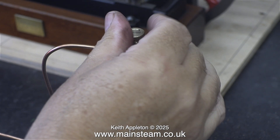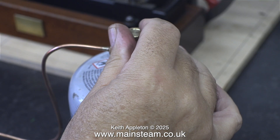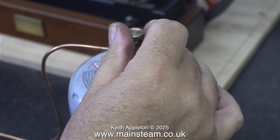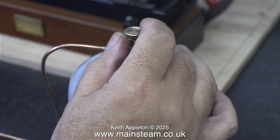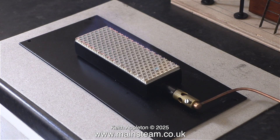I don't need a lot of gas pressure with this Bix burner for this boiler, and I'm currently using a canister that's almost empty. On a nearly empty gas canister I'm opening the gas valve slightly more than I normally would. It's really important with new gas canisters to not open the valve very far. These Bix burners are different to some other ceramic burners — they do not need to glow red; in fact, it's a disadvantage as they can burn out.